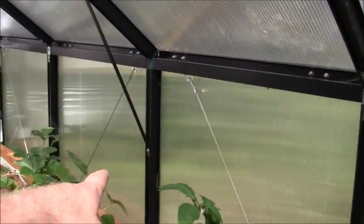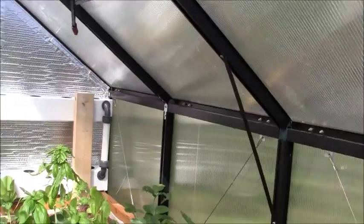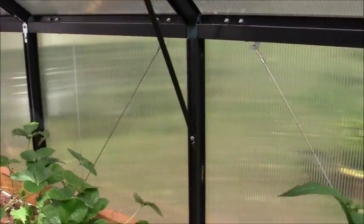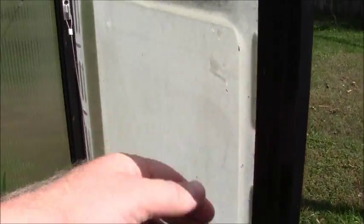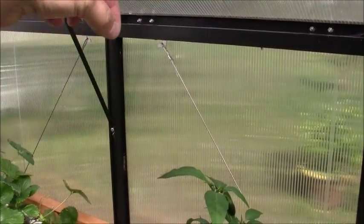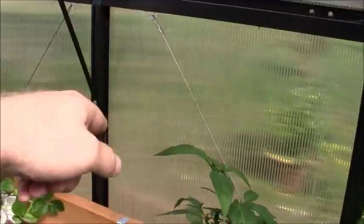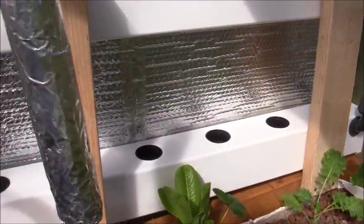It's starting to be fall time here, so I put my greenhouse back together. Instead of using the cheap PVC, I used twin-wall polycarbonate — this one's actually a quarter inch thick, so my wall is actually thicker than my roof now, which means it'll last a long time. I had to come back through and pry open those little channels all the way around to pop these in, and then I cut off the top section — that's for another video.